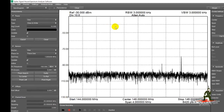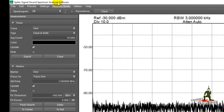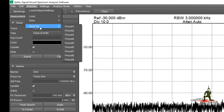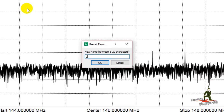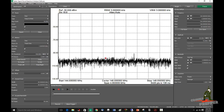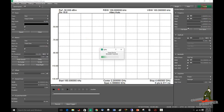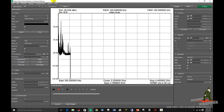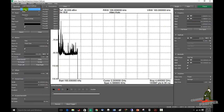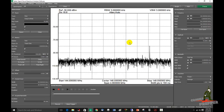So we're going to load this preset into preset 1. Preset, save, preset 1. Now we'll come to preset, rename preset 1 to '2 meter band'. We'll hit OK. I'll go ahead and demonstrate how that works real quick. We'll hit the preset button to reset the unit. The unit comes back up after being reset. We'll come over here to preset, load, '2 meter band'. And now we're scanning the 2 meter amateur radio band.